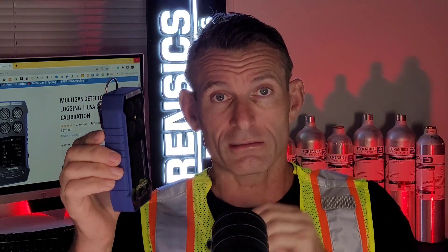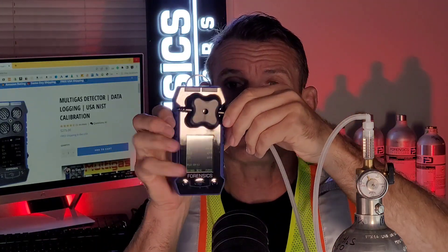I'm going to show you how all this works because a lot of people get confused, but it's quite straightforward. The calibration cap is right here - it's just a little manifold that fixes onto the monitor. You grab the little tube, pop it on one end, and over here we have our four-gas calibration cylinder that mounts on the front of the monitor with the screw.